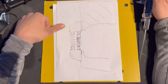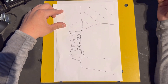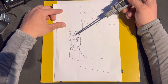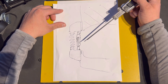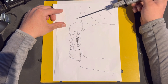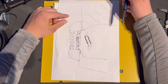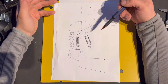If you had those springs in line with the shaft you'd have no real tension for the overhanging torso piece. The springs need to hang over the back to allow for extension. Something else that worked well on this design is that it accommodated physical irregularities — if the belt sat a little differently compared to the torso depending on how it sat on your body, the knuckle joints would essentially morph to the user's posture without any issue.